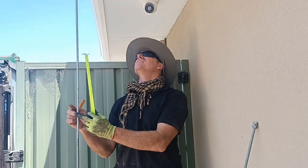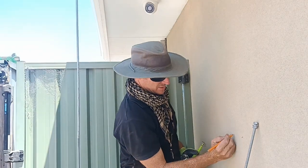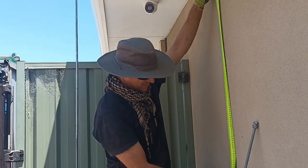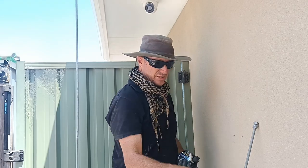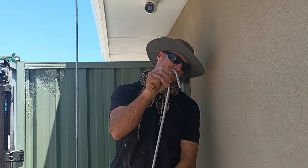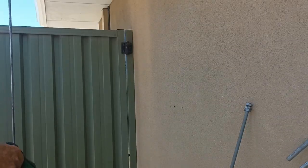Now how I mark where it is - see this one hanging down, that's bang on the purlin, so I want it to come right to there. 950. And now I'm going to drill a hole through there, put a rod through there, and then we're going to catch it with this hook here. That's how we're going to do it.